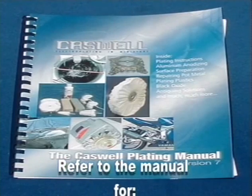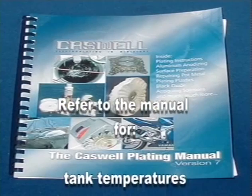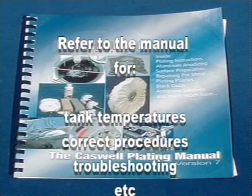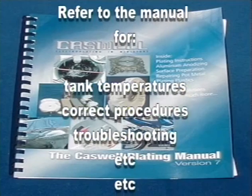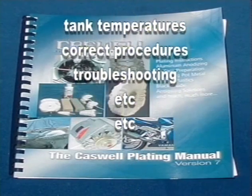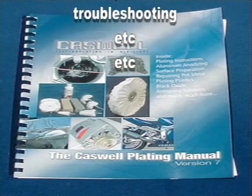It's often a good idea to reverse plate for 30 seconds in the copper tanks to etch the nickel plate and improve adhesion. Try plating a copper pipe directly with chrome because sometimes it's difficult for the untrained eye to see the chrome over the nickel plate. This will show you the true color of the chrome.